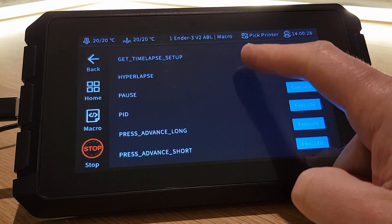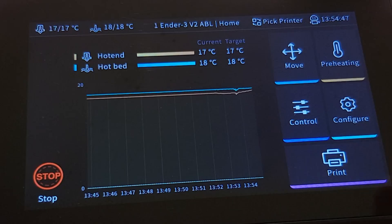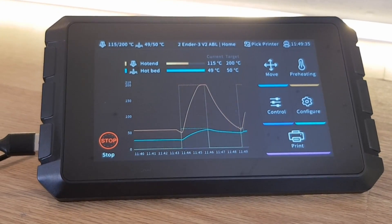Some of the other things you can do with the Sonic Pad are setting macros, so you can initiate more than one command with a single button press. You can preview what your model will look like before printing it, and you can access everything from a computer or smartphone if you're on the same network. There's currently no easy way that I know of to access your Sonic Pad when you're not on the same network. I've found the Sonic Pad a much simpler way of using Klipper with a 3D printer and achieving high-quality, high-speed results. It is more expensive, but the world of Klipper firmware has now been opened up to those of us who don't have the time or desire to learn about Linux-based operating systems.